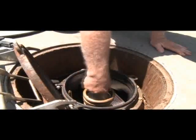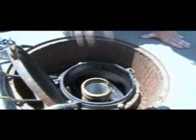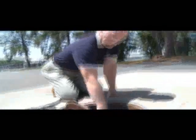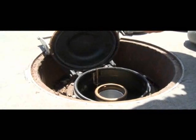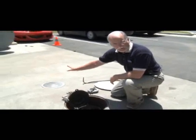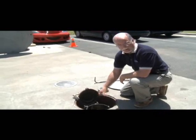Inside there's a drop tube — an aluminum tube that goes down inside the tank. The drop tube has an auto-limiting valve that does not allow more than 95% of the tank's capacity to be filled by a jobber. It floats up and shuts off the fuel flow before they can overfill it — this is a regulatory requirement. This will also alarm on our automatic tank gauge system inside so owners and operators always know if there's too much fuel. In some setups there's an audible alarm outside for the jobber; in this case there's no audible alarm, but the auto-limiter valve physically stops the fill.